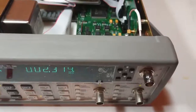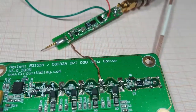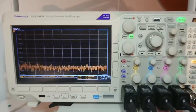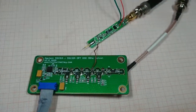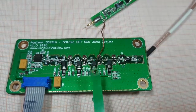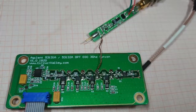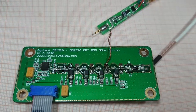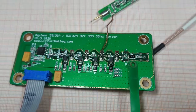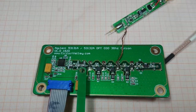Let's do some quick tests. As I am not an RF person, I have limited means to test this port. I have a DIY-style active probe and my MDO 3000 spectrum analyzer which goes up to 3GHz. This is the board under test. You can see on the board there are 4 RF amplifiers — cascadable 50 ohm gain blocks — providing around 7.2 dB gain per stage from 100MHz to 3GHz. Input is connected to an MCX connector mounted on the back, followed by a large power package anti-surge resistor and 2 clamping diodes for input protection, then 4 stages of MMIC 50 ohm gain blocks.